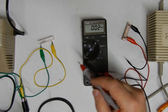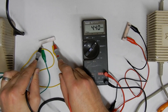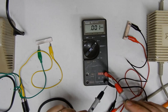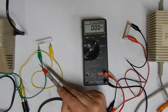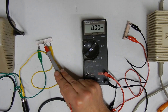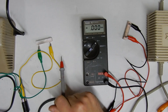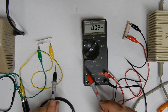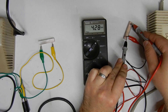As long as the pins are separated and we've got our load hooked up, we should still be getting about 5 volts across these resistors. This one is getting about 4.4 and the other one about 4.3. This setup is simulating the Commodore 64 at its maximum load — we're pulling about 1.5 amps out of the 5 volt line, which is the maximum these are usually rated for, rated between about 1.5 and 1.7 amps.